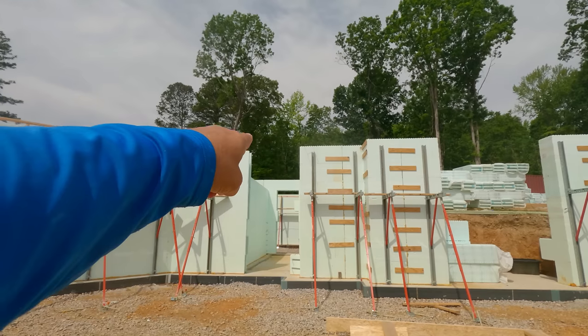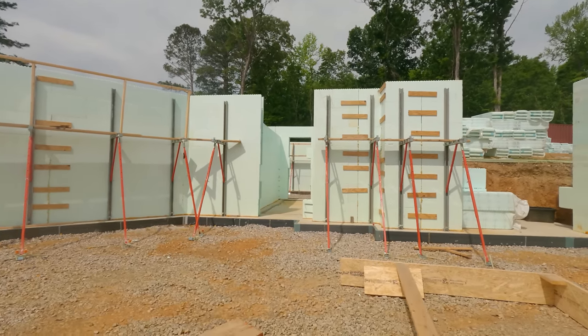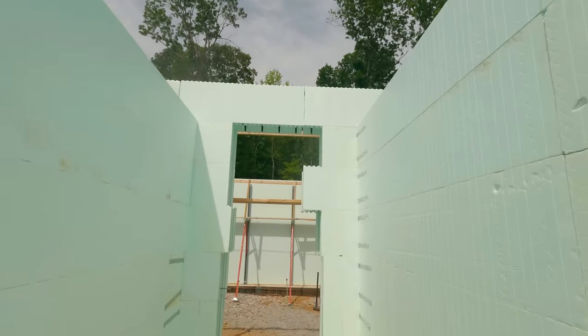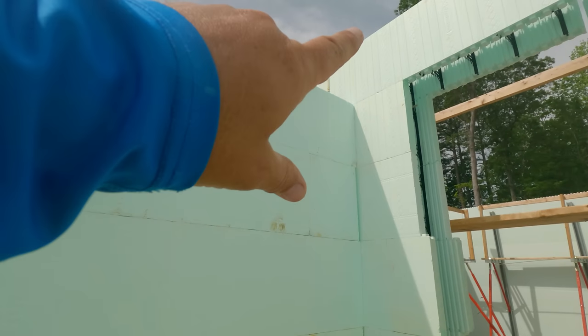We determined that the concrete height needs to be 6 inches lower than the house. So poured height of concrete, right, for the garage and this drive over tunnel. So right now we're 18 inches. We want to be 6 inches down finished, which would be 12, and then concrete will be at least 4 inches thick. So that brings us to 8. So I need to cut some pieces down to 10 inches, put those on here, and then when we set our floor joists in here and the pan and pour concrete over it and seal it and everything, that should be good.